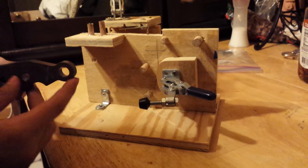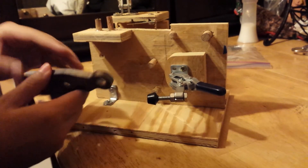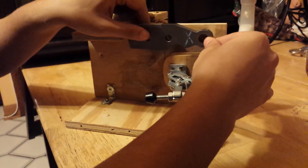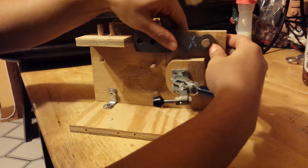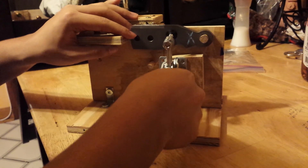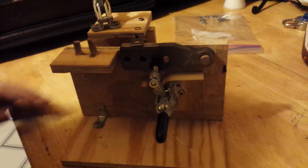Use the fixture to get all positions on this part. Make sure the part is aligned with this wall and that these two holes are aligned with these two dowels, and place it in. Move the clamp into position, clamp it down, and move the hole guide into position. Then you're ready to drill.